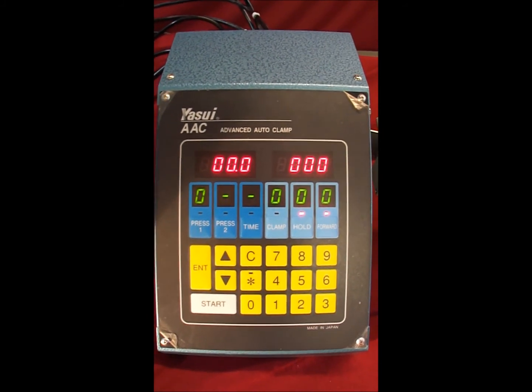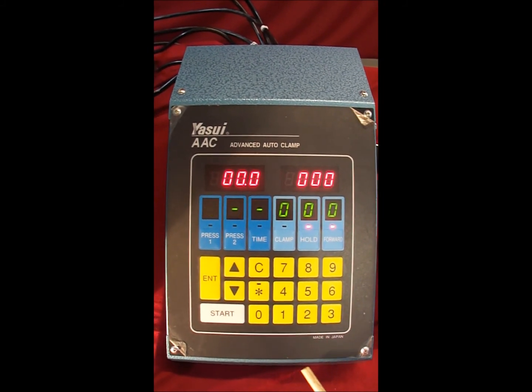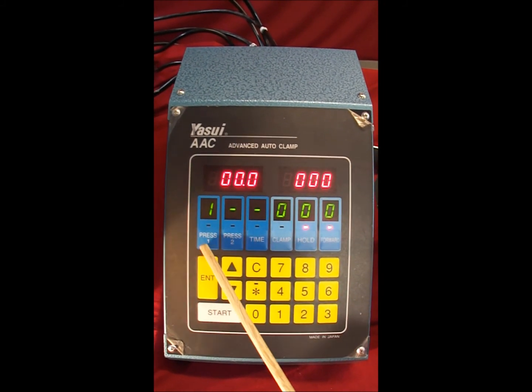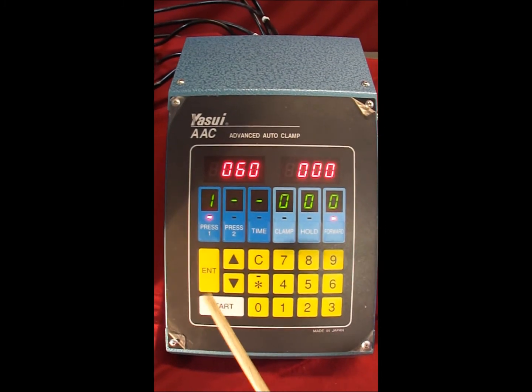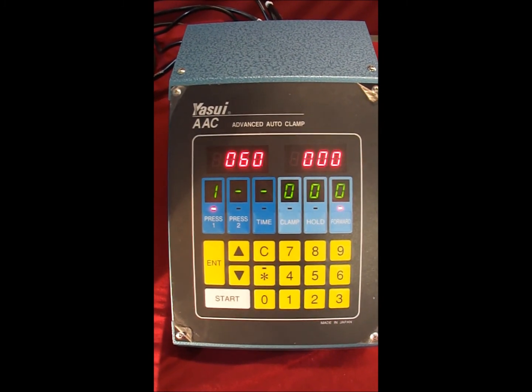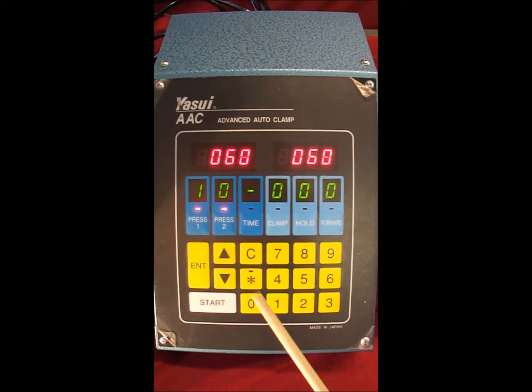So you can save that setting into your mold clamp, writing that particular setting onto the rubber mold as program number 63, and therefore there's no more thinking involved when you want to get proper and clean waxes the next time you need that rubber mold.